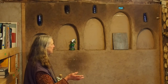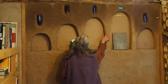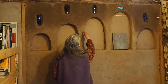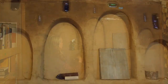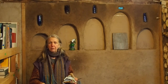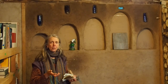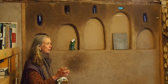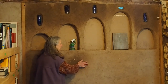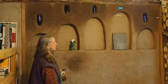We had a lot of fun with this particular wall. We added some bent wood pieces into this stud frame wall — where the studs were — and created those arches, then just plastered over that. This is an interesting way if you've got a regular stick frame wall and you want to create your own finishes without having to use drywall or anything else. We've put light straw clay on and then a plaster over top of it — behind this is just the studding.